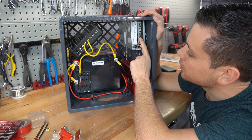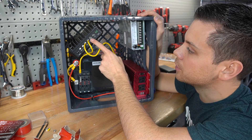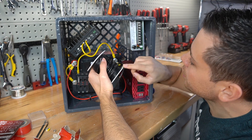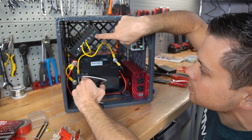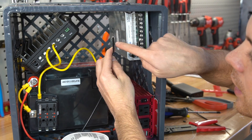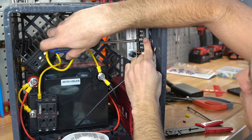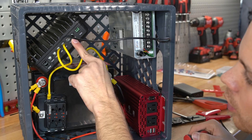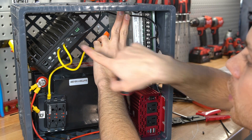Because we're working with only 10 amps, we can use a smaller gauge wire — some 12-gauge wire connecting from DCV plus to PV plus and V minus to PV minus. Both terminal blocks can accept wire directly, so all you need to do is measure, cut, strip, and insert — no crimp connectors needed for this step. Work with one wire at a time because you do not want to mix up the polarity. If you connect V positive to PV negative, you will have a problem.